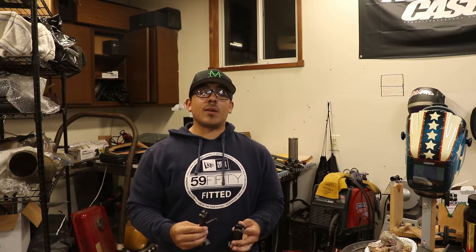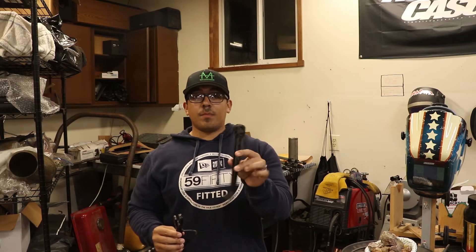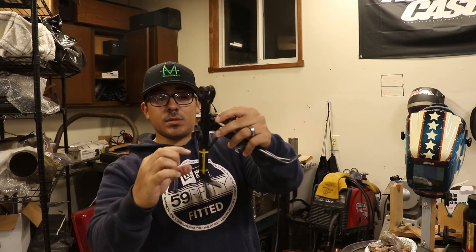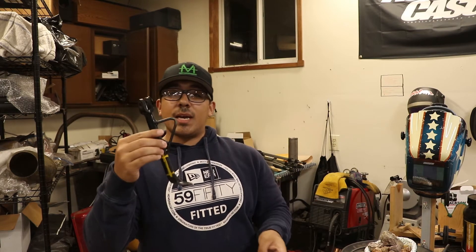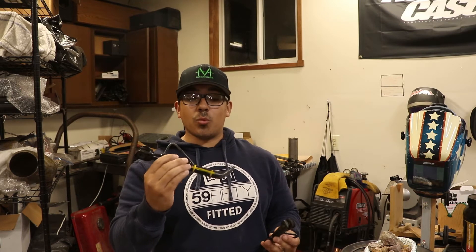What's going on guys? Welcome back to AMA Garage 253. I'm Andrew and tonight we're actually going to be working on a modification for a Honda Grom. The Honda Grom is lowered and the normal kickstand that comes with the Grom is too large for the lowered bike. So what we're going to end up doing is cutting — I already marked this one — cutting a section out, pushing it up, and welding it back together. It's a DIY fix for the Grom instead of having to go out and buy a brand new one that will basically work for a lowered Grom.